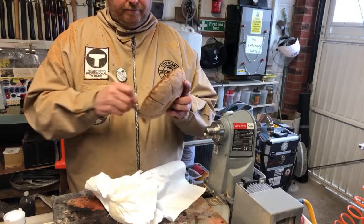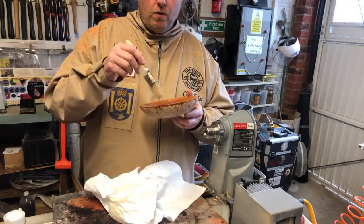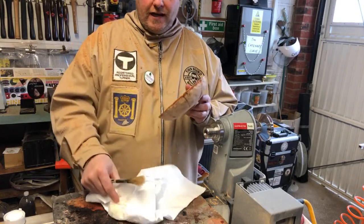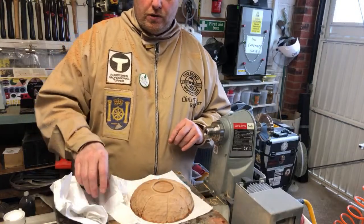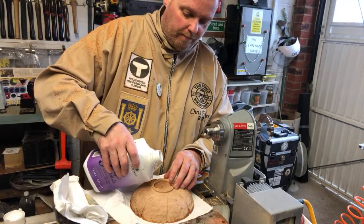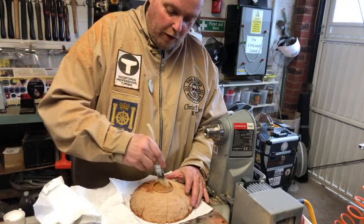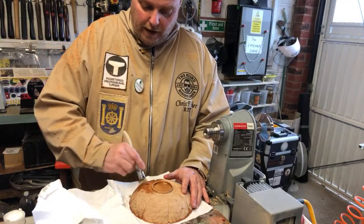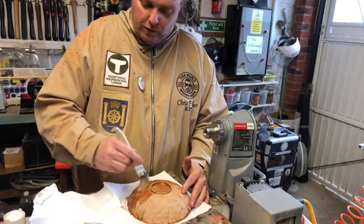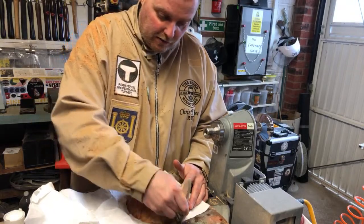Do you always use cellulose sealer? This is a food safe finish. When I'm after a high gloss or a polished finish, yes, I do always use cellulose sanding sealer, and then friction polish on top of that. That's just what I've always used really since I started turning. My finish of choice, unless I want it to be food safe, and then I can use obviously food safe oil like this one from Terry and the guys at Chestnut. So